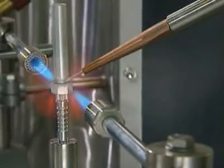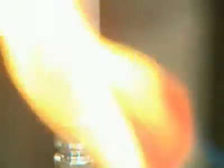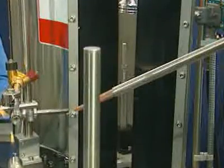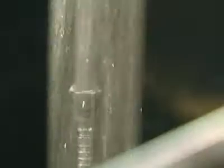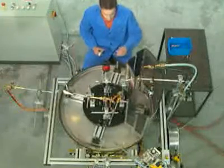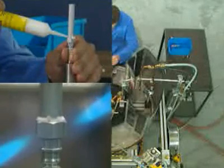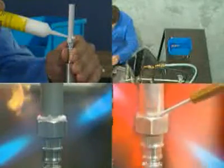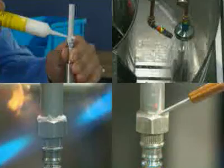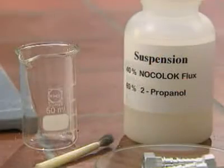The filler alloy is applied using a brazing wire feed cylinder; the quantity of filler metal is adjusted by the feed time and transport speed. The completely brazed component is cooled first with a water spray and then an air spray to ensure rapid further processing. The carousel brazing machine has four workstations — in continuous operation one component is processed at each station simultaneously. The cycling speed, preheat and brazing duration, quantity of filler metal, and cool-down time can all be adjusted individually. Whether you braze by hand or by machine, with flame brazing you will always make the right choice with NocoLock flux.